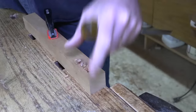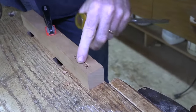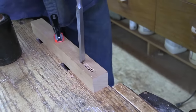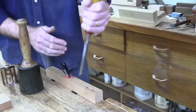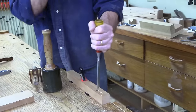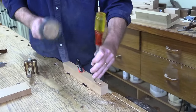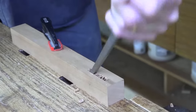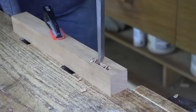Once you've got that initial channel, you don't have to position as much — you just keep following it. I'm standing and naturally positioning myself sighting the chisel plumb with the bench. I always want to keep it going straight, plumb in both dimensions — not going off at an angle. I'll go across one time, then come a little closer to the bottom, about an eighth of an inch closer, and do the same chipping method.